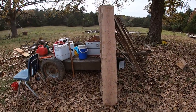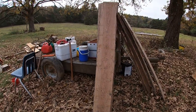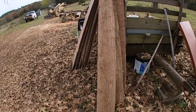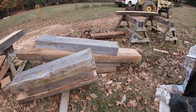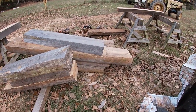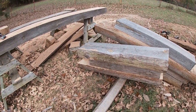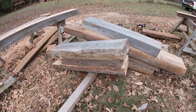I've been working some pieces out to do the repair on the corner beside the fireplace where I'm taking the window out. Part of the logs is still pretty solid, so I'm going to attach some faces on the inside and the outside and put an upright post up against the fireplace that will go all the way down to the footing and help support all of this. These pieces are pine that I had left over — I milled them down to five inches, which is close to the thickness of the old cabin logs that run anywhere from five to five and a half inches.